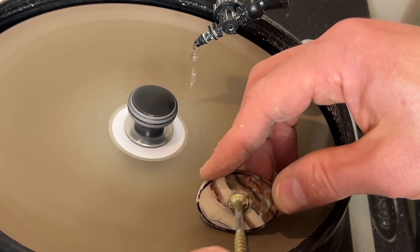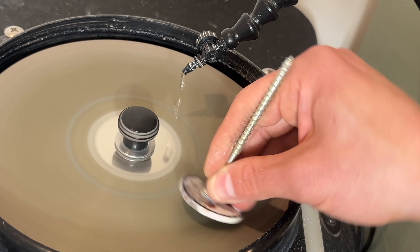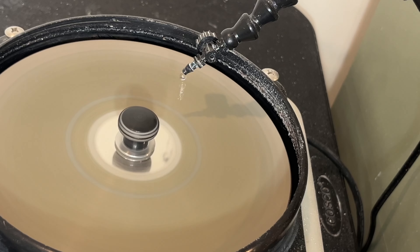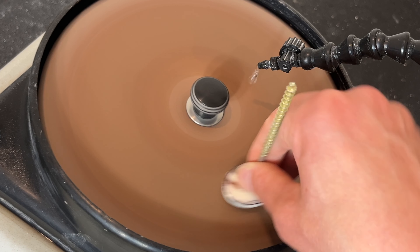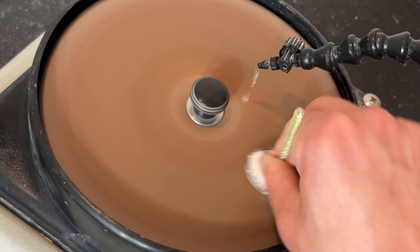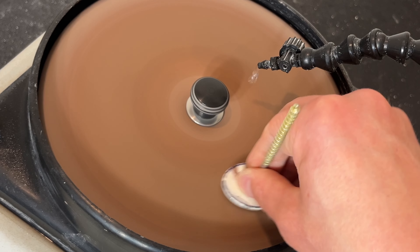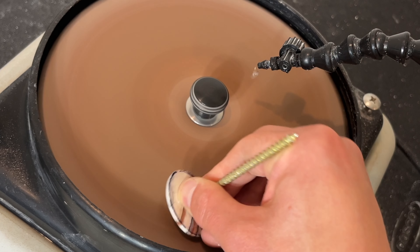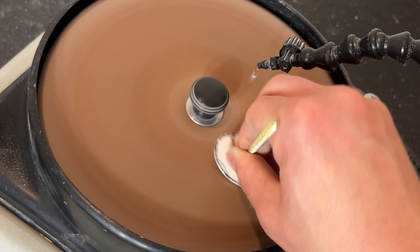At one point I thought I was good with the shape here and ready to move on. But if you watched the live stream of me making these, you saw that I eventually realized I didn't make enough of a dome on the top — there was still a big flat area in the center, so I had to jump back to this plate a little bit later. You also may have picked up on the fact that I mixed up the 325 grit rubber backed pad with the 220 grit one, and I wound up wasting a lot of time before I realized the pads were in the wrong order. But eventually I got the shape I liked with a dome I liked and I made it through 220, 325, 600, 1200, and 3000 grit pads.